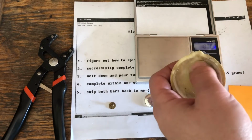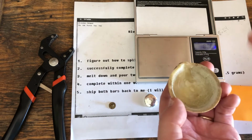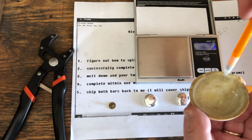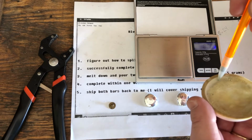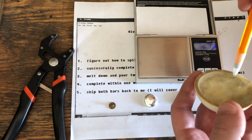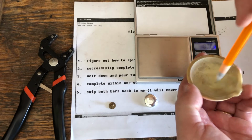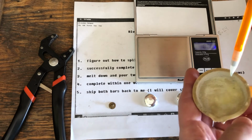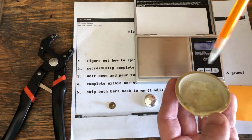You can see, just from the borax I put in there now, it has a glossy surface. That's what it really should be, so that metal floats on it. But if you look right here, you see little flecks. I suspect those contain tiny pieces of silver that have melted, and instead of collecting at the bottom, they collected towards the top, because of my poor melting skills. And yeah, so they're up there.